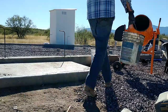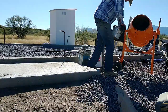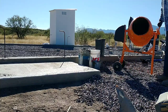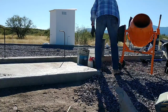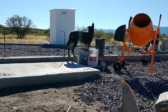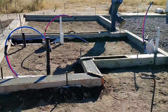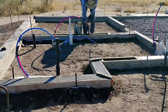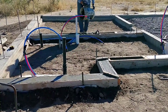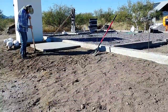I'm using a 1-2-3 ratio: one part cement to two parts sand to three parts gravel, which is a high-strength mix — I believe around 4,000 to 4,500 PSI. I also used rebar in the footers to make it as strong as possible. Here we're just finishing off the last bit — we left some spots low where the doors will be, pouring about an inch and a half lower there to make a nice transition.